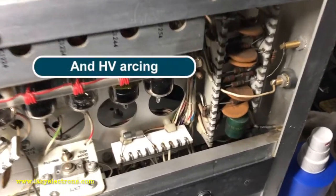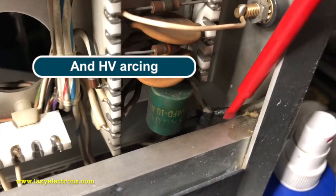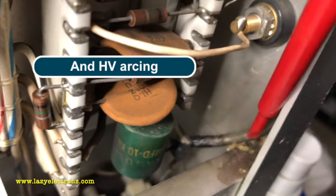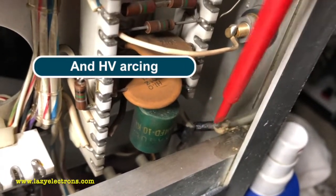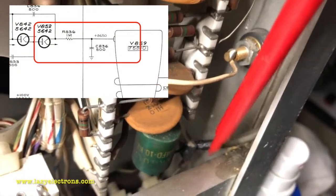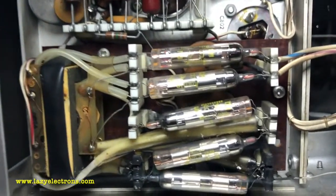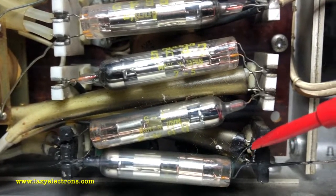First issue: there was a hissing as soon as it powered up, right over here. Some sort of dust — technically I didn't clean it properly — so that is arcing the HV to the chassis. I have to clean all this cable; this is the anode cable to the CRT. This is the high voltage section and the hissing I finally traced out to be coming from here.